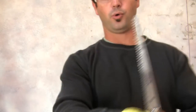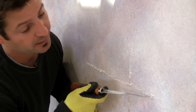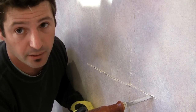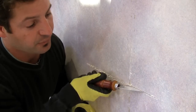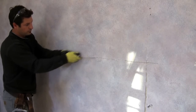It also makes a lot of dust. You can use a jab saw — basically a drywall saw with a sharp point on the end made for digging into the wall. When I'm taking the saw across, I'm being very careful not to go too deep, because if I push it in really deep, I could cut through wires, ductwork, or a pipe, or electrocute myself. So I set my knife to only cut half an inch deep — the thickness of the drywall.